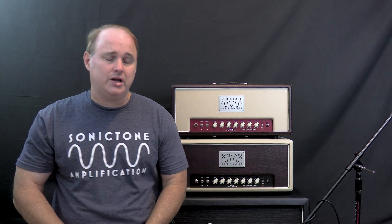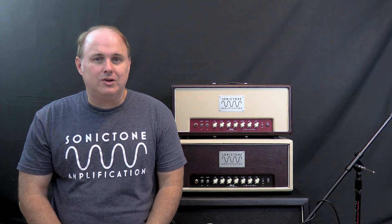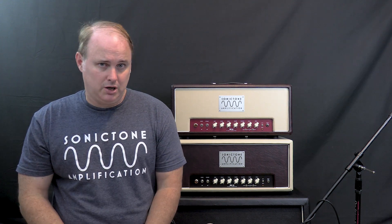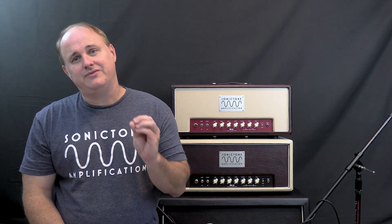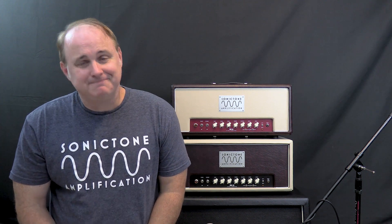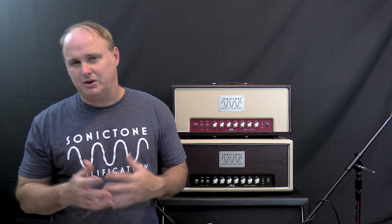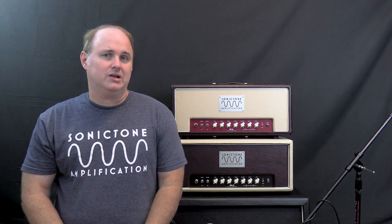So amps like the Vox AC30 — that's one that's out there — where people will say it's a Class A amp. There's an amp builder by the name of Randall Aiken who does a deep dive in a tech article on his website that talks about whether or not a Vox AC30 is a Class A amp — I'll put the link in the description below. In that article, he does all the scientific data and graphing that charts the voltages and everything in that amp to prove once and for all whether or not that amp truly is Class A. Spoiler alert — it turns out it's not. It's actually Class AB. But he goes a little bit further and talks about what it would take to convert it into a Class A amp, which is a little harder to do than you might think because the voltages need to be set differently — they're typically lower in a Class A amp. So it's not like you can just flip a switch and convert an amp over to Class A.